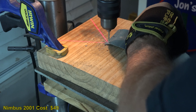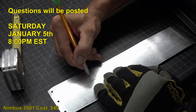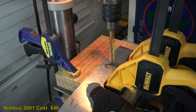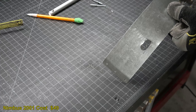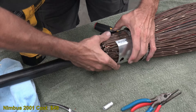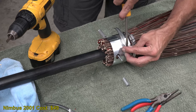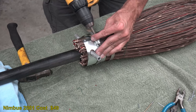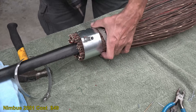Remember, the drill bit here should be the same width as your pop rivets. So I measured from steel rod to steel rod around the outside of the broom, then went back and marked on the tin with a pencil. I simply drilled out two holes on each side slightly overlapping each other — the drill bit is the same width as the hollow aluminum rod. Then with a pair of tin snips, I cut off the excess between the two holes. Place the banding back around the broom and with another pipe collar, crank it tight until the rivet holes are at least a half an inch past the edge. I place a couple of hollow aluminum pieces over the steel rods to ensure I have an even space around the holes as I tighten the banding. Then finish drilling out the holes through the tin — the pre-drilled holes from earlier should keep you aligned. Then insert your rivets. Now you can remove both pipe collars and see what you have.